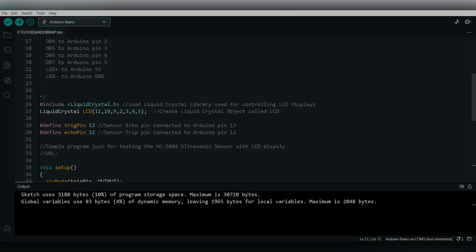Now I'll explain the code that measures the distance between an object and the sensor. I'm using an ultrasonic sensor, jumper wires, an LCD display, and an Arduino. First, we include the LiquidCrystal library because we're using an LCD display. We then create an object called 'lcd' and specify the pins connected from the LCD display to the Arduino as its parameters.